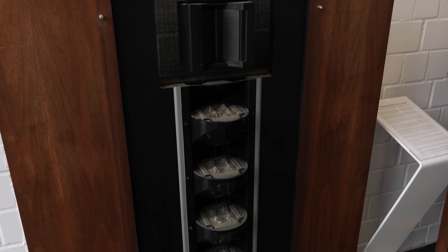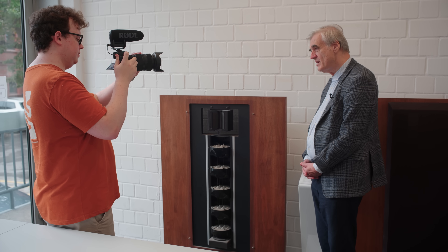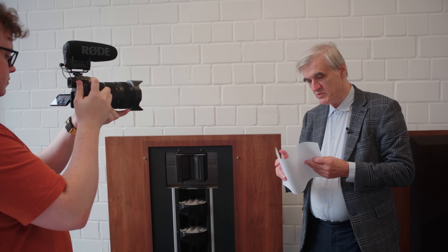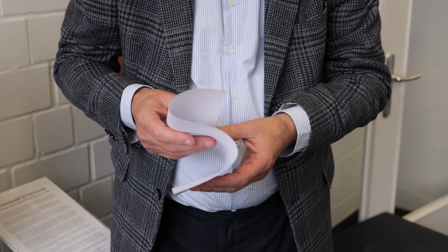I'm Klaus Heinz, and I have a long love with loudspeakers and transducers. This is quite a unique-looking contraption. The original air motion transformer idea starts with a diaphragm with folds in the middle of an air gap. The air motion transformer uses folded diaphragms where the single folds open and close, and the air is going from here to there — as you can see in this model.